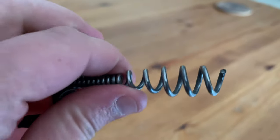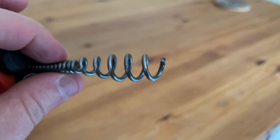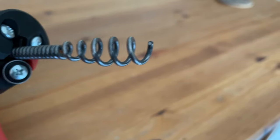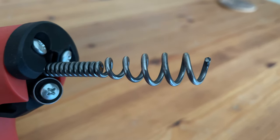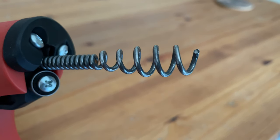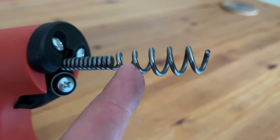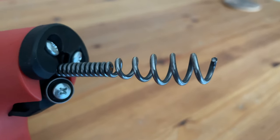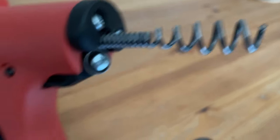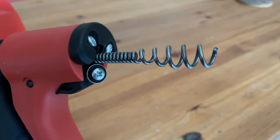Now this is the end here. You insert it into the drain and basically turn on the drill. It spins around and also brings it forward. So you can basically clear your drain pipes with this metal rod — it grabs all the hair, all the gunk and everything like that. Then you just reverse the spin, press on this lever, bring back the rod, and take it out.